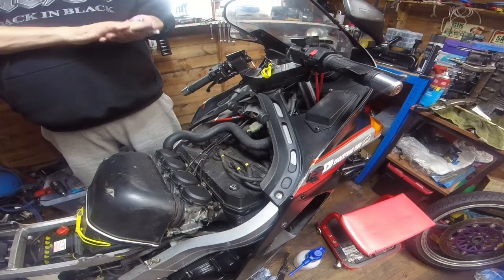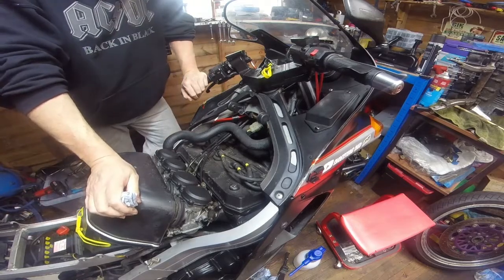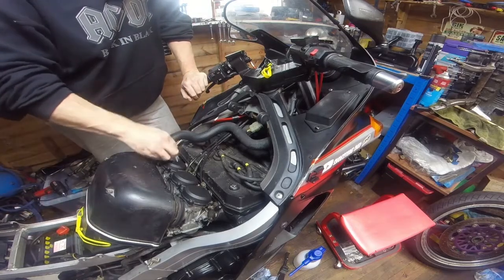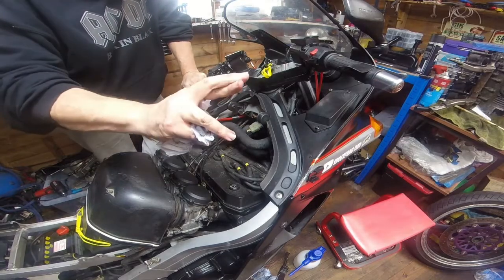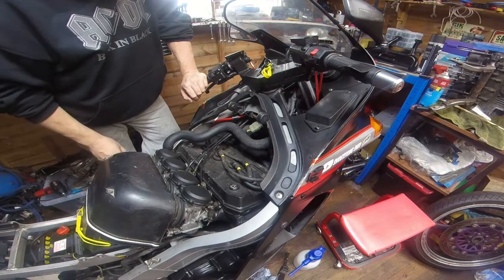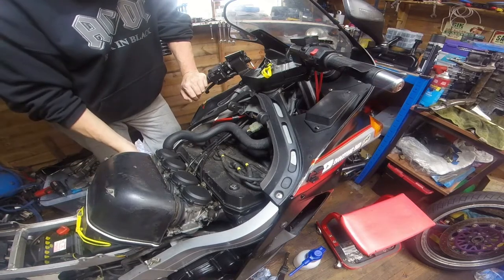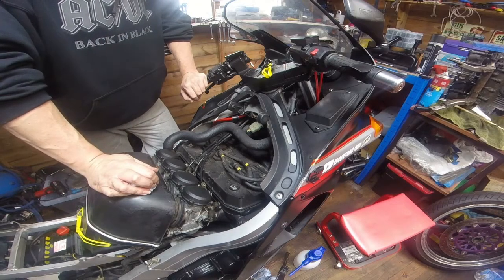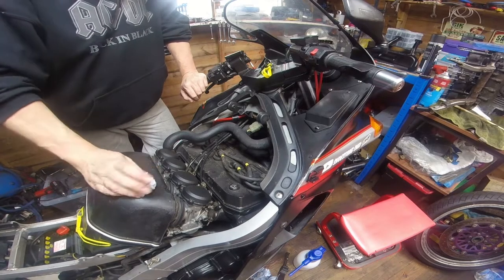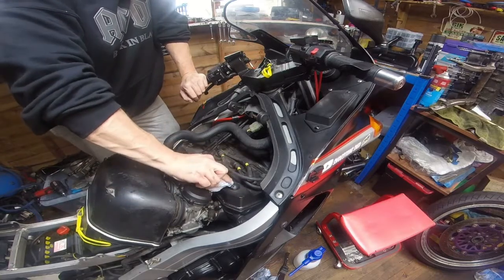And the petrol I got for the pump, I've got a full can, no expense spared, is to top Nibbler's tank up as well, because he's a bit low. So hopefully, fingers crossed, it'll start better. What I'm going to do next is reinstall the tank, reattach the fuel line, and obviously we've then got to wait for the float bowls to fill.